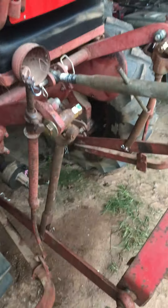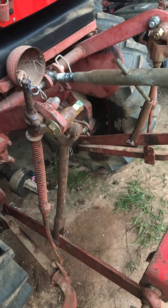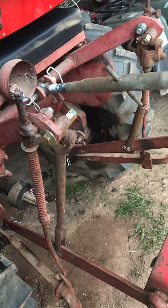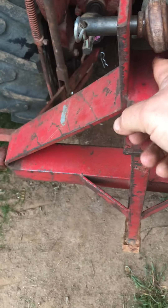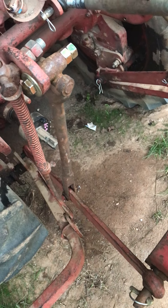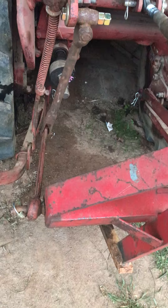At a minimum, I can make an adapter for about $250 — that's with a Harbor Freight quick hitch and a prong from Agri Supply for another hundred bucks. But I've got to get a prong for each implement I own. It'd be quicker just to get the adapter going. JT West has a nice example of one of those one-point to three-point quick-hitch adapters in action on a disc. Most implements still aren't going to work with the quick hitch anyway. We're gonna continue using this homemade three-point hitch. My Super A does not have a homemade three-point hitch — it has an actual aftermarket three-point.